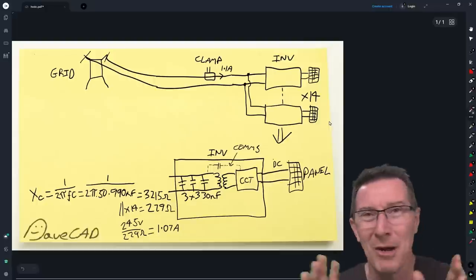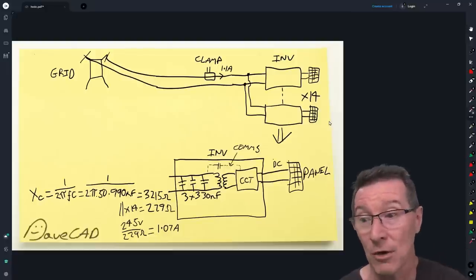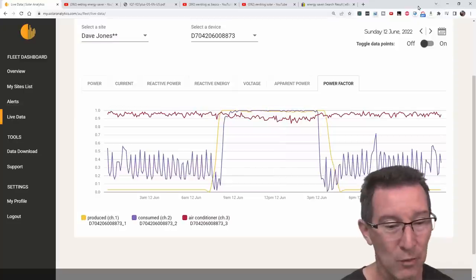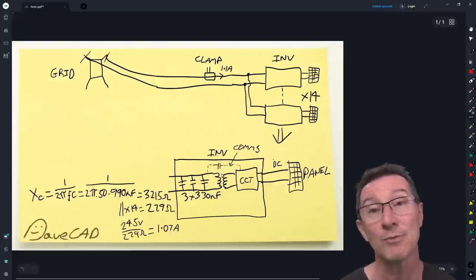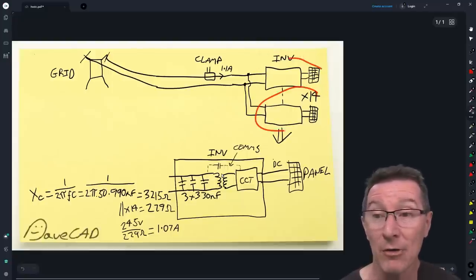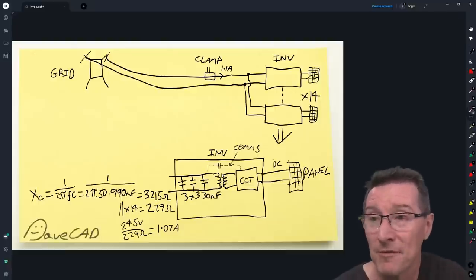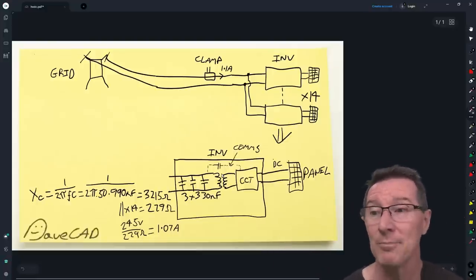I'm not going to show all the switching components; it doesn't matter — it's down in the dregs. We know the power factor is very close to zero, which means it's almost entirely capacitive. That yellow line for the power factor is bordering on zero, so in this particular case it's going to be entirely capacitive. We've got almost a microfarad of capacitance there. And of course we have 14 of these micro-inverters all in parallel — so that's actually quite a significant amount of capacitance always connected across your mains. But this may be beneficial if you've got lots of inductive loads.